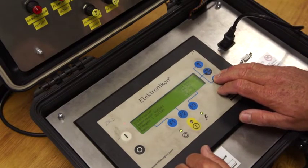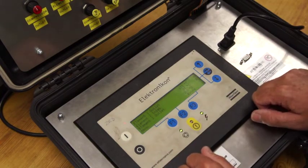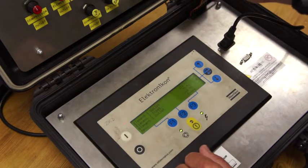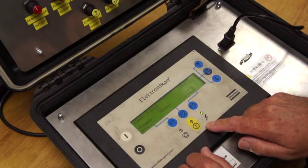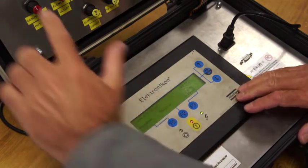The other trip I'm going to show you: let's get these three up — element 1 outlet, element 2 inlet, element 2 outlet. If we had an intercooler temperature problem, for example the 35°C temperature would rise. I'm going to take the temperature up now — when it gets to 70°C it's tripped, completely tripped the machine, and we're going to have to do a reset.